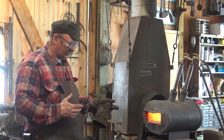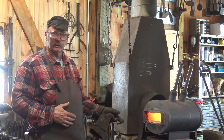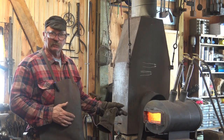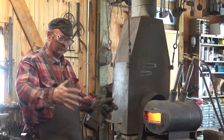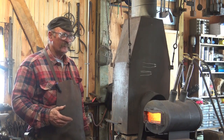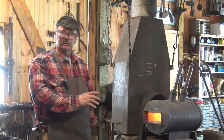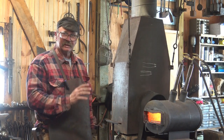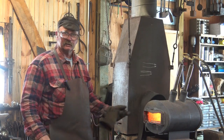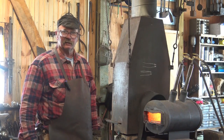You also have to accept the fact that sometimes the gas forge is going to heat up more material than you want, and that can cause particular issues — especially with a drop-tongs type weld because you end up with way more material hot than you need and it makes things floppy. But you can deal with all that. You also have to realize that your forge is going to deteriorate faster at the higher heats, and that flux is going to eat the floor of your forge and you're going to have to do maintenance — that's just the way it is, it's not a big deal.